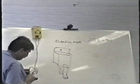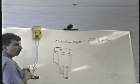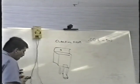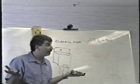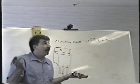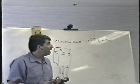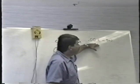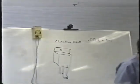On the minus 5-volt diode, I get the same thing both directions. I'll either get that, or 0.099, or 0.1, or something that seems bad, doesn't it? Seems incredibly low, it seems bad. That is actually good. When the diode fails, you read 0.00 something.